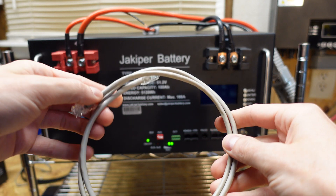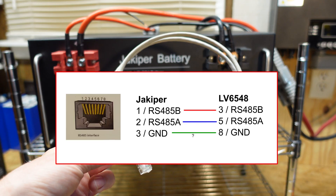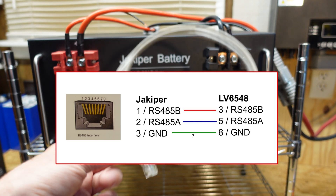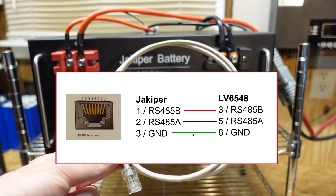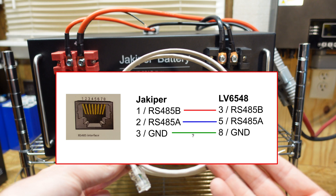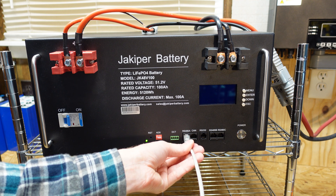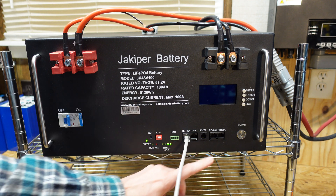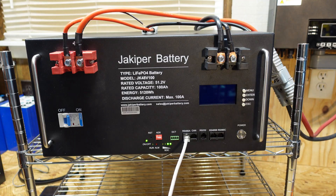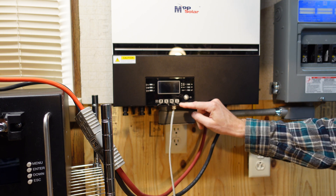Next, you need to make your RJ45 cable for the RS-485 communications. I used three pins in this cable: RS-485 A, B, and ground. It's still debatable whether or not that ground reference pin is required — MPP Solar says just to use A and B, but many wiring diagrams say you need the ground, and many say you do not. I did put a question mark on the ground pin, so it's up to you. Make sure you do not mix up the ends — the Jakuper end goes in the port marked RS-485A; you cannot use ports B or C as those run on a different protocol and baud rate. The MPP Solar end goes in the BMS port on the MPP Solar inverter — not the PC communications port; it must be the BMS port.